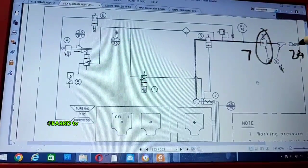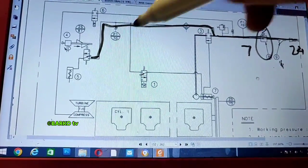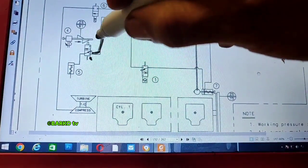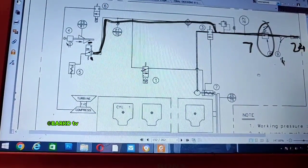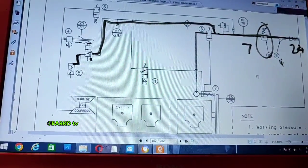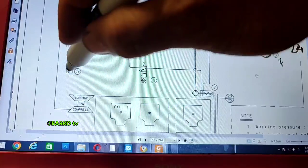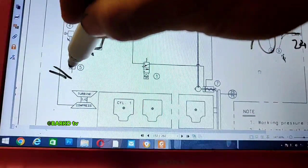There is a reducer — compressed air passes through this pipe going to the pneumatic valve, a 3-to-2 way valve. There is a spring return, and for activation there is a push button. When this valve activates, it gives air to the stop valve — the stop valve is also the lambda cylinder.